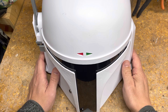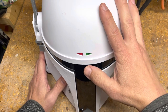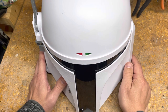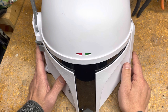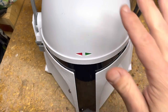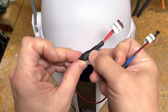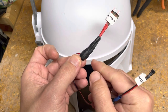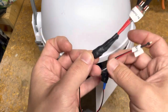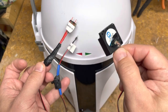This is what it looks like with the fan and amp installed — both covered in previous videos. The fan system is essentially a kit I put together: a 3.7V to 5V up-converter, also called a voltage booster. That's to take the LiPo battery power at 3.7 volts and up-convert it to 5 volts for the fan.